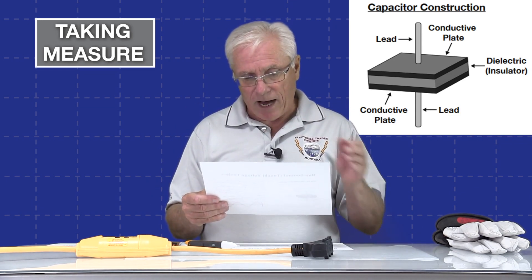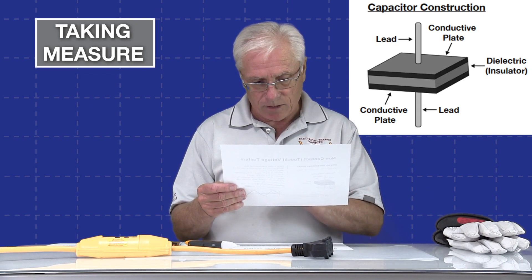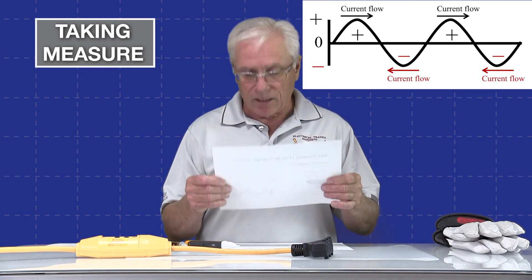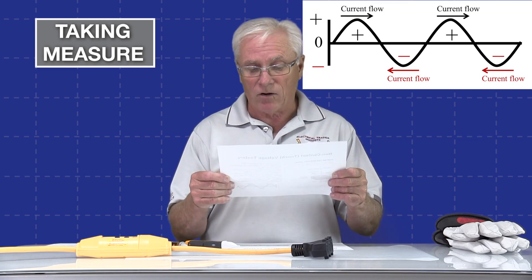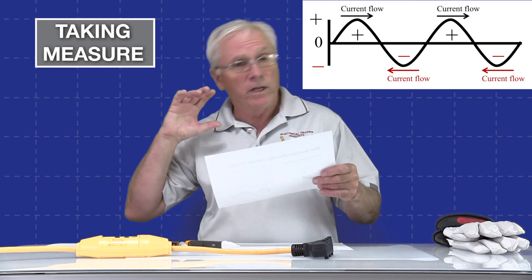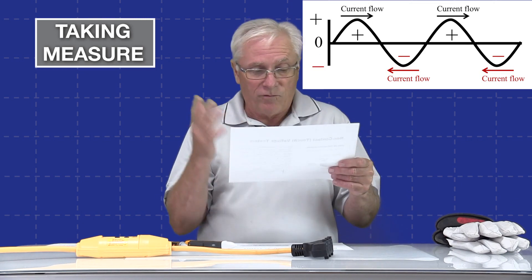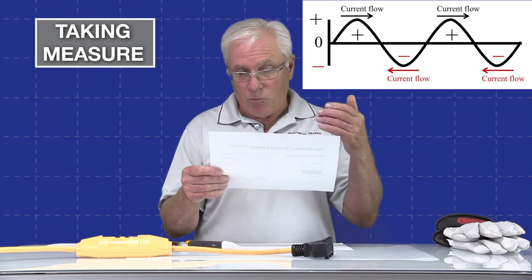I also have an AC sine wave shown. Energy is stored in an electrostatic field. When you connect a voltage source to a capacitor, it will charge and store the energy. Capacitors in a DC circuit will charge and then block current flow once they fully charge — it basically fills up, the charge completes, and then it blocks current flow because resistance is effectively infinite. Capacitors in an AC circuit will allow current flow by storing and then releasing energy with each current alternation.